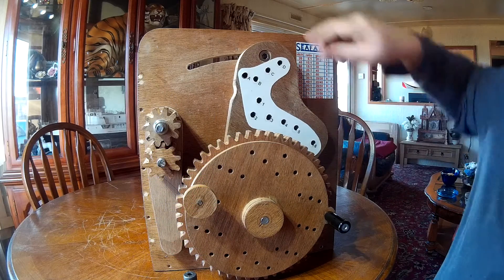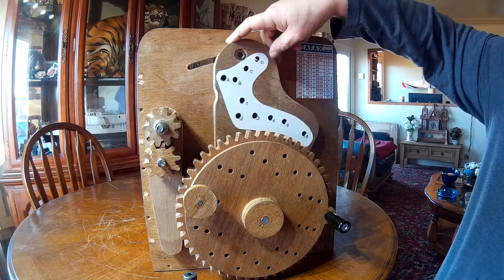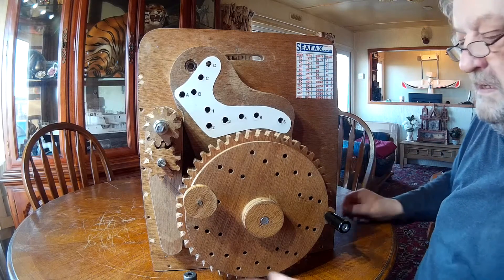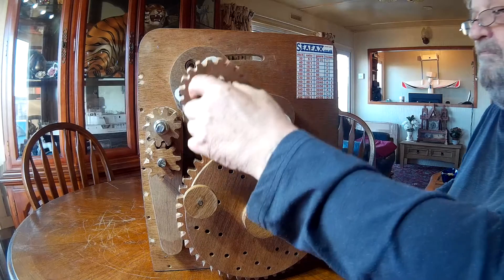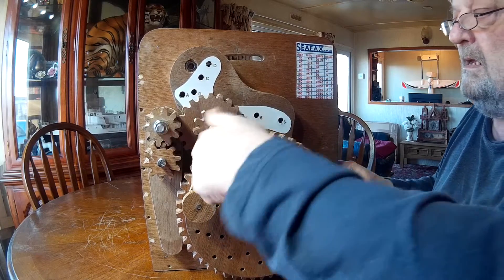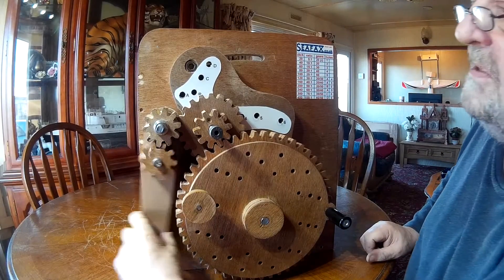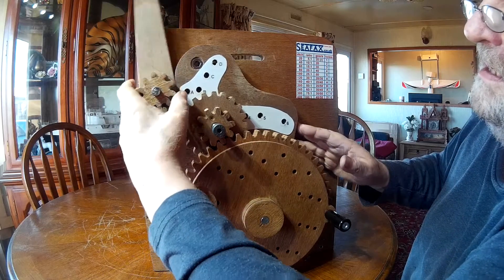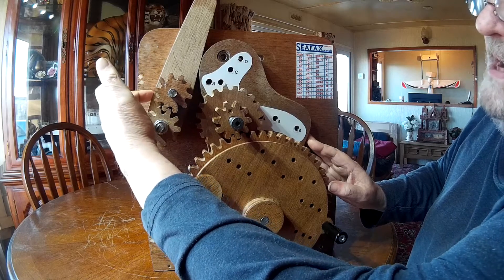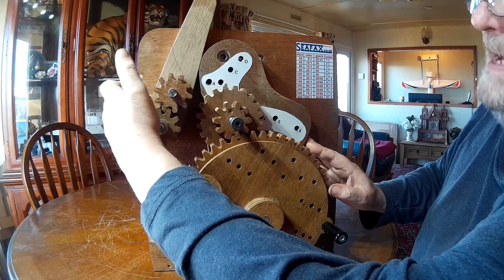The other thing I've done is add the slider — this gets used primarily when you're reversing the gear. All that remains to be done is just pop a gear in. When you want to reverse, I have to chop this lever down yet, so that this gear will actually mesh with that. The handle for operating the lever will come out on the back behind the gears.